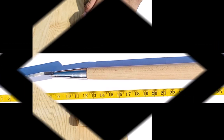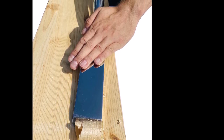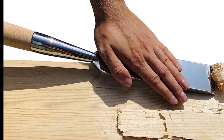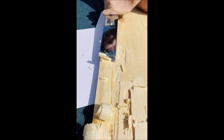Where it is impossible to work with an axe, a hand plane or a draw knife, the two-handed woodworking chisel does the job perfectly. It is especially good where both efficiency and accuracy are required. The large, very large area of its knife allows you to place a wood chisel on a flat work surface and manipulate the chisel like a hand plane, leveling the work surface.